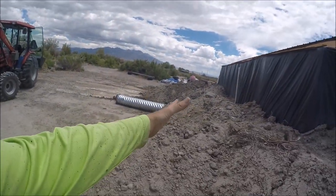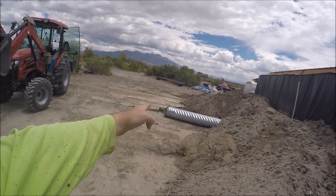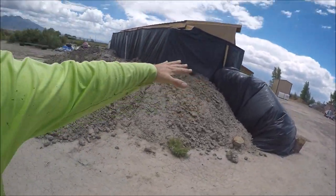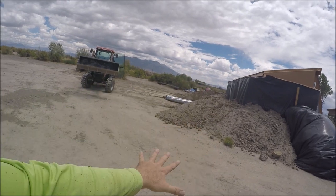This pile of dirt was fairly continuous, and so you can see what that's added already. I want to get it wide enough so that the angle of it goes just past this, get it fairly flat on top, then I'm going to drive my Jeep over it to compact it. I may end up building a ramp out this way, and that's what I think I'm going to end up doing, building a very gradual ramp that I want to compact with the Jeep and then the tractor,